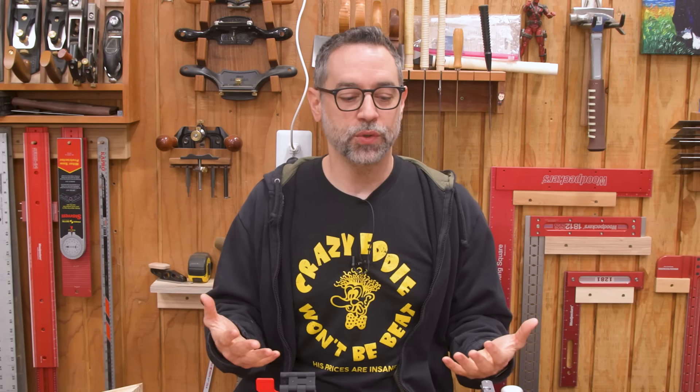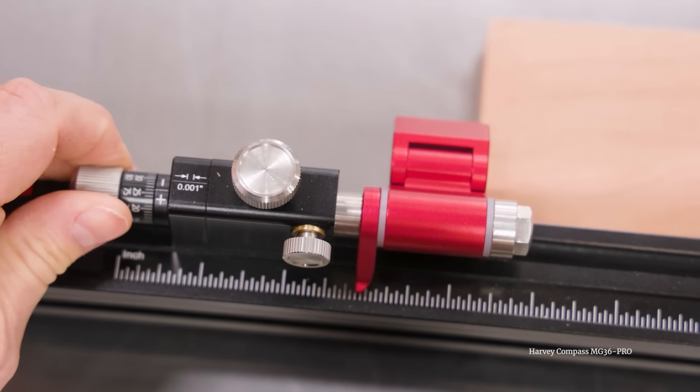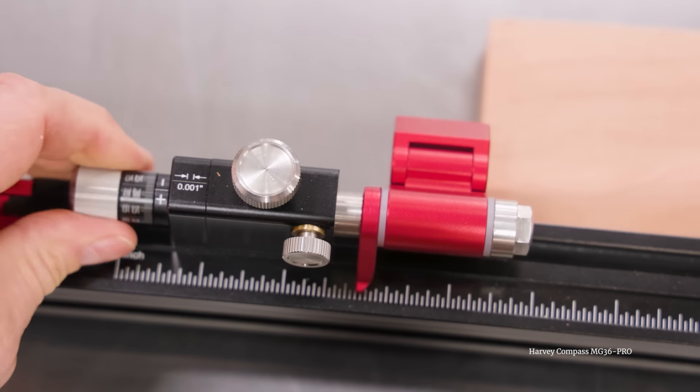So I referred to the micro-adjustment as rudimentary — here's what I mean. If I were designing a shop-made jig with some kind of micro-adjuster, I'd install a threaded insert into a fixed block and then use a flat-headed bolt as the stop. Simply rotate the bolt in either direction and — micro-adjust. But when it comes to a $450 miter gauge, I expect to see something a little more sophisticated than that, like we see with some of the competition. Others feature a stationary dial on one side with the stop moving on the other, and those systems have built-in resistance allowing the dial to hold its settings. The SawStop adjustment just feels a little clunky in comparison.